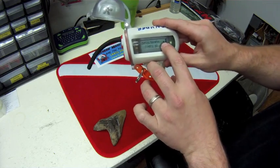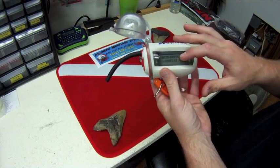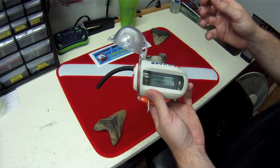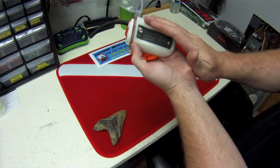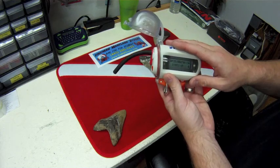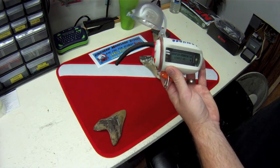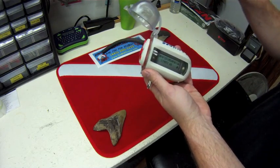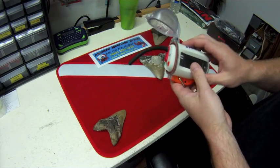Once the satellites have locked on, pressing the distress button would start transmitting your GPS coordinates, your Maritime Mobile Service Identity Number, and a distress signal. Anybody with a maritime radio — mobile radios, base stations, boats, or people with these units — will start hearing that distress signal. Newer VHF handheld units that hook into GPS will actually show your exact position on screen, up to a couple feet away. Short of an EPIRB, this is phenomenal for divers out in the open.